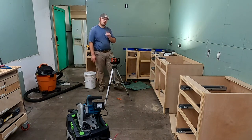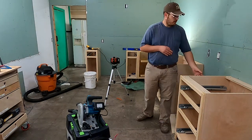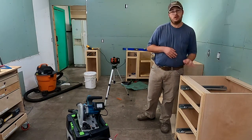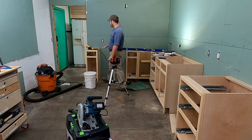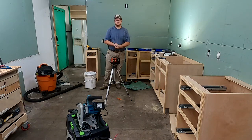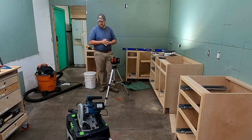Thankfully I'm doing this before I put in my floors, so I can use my floors to offset some of that gap. I'm actually going to start by mounting this one at my 34 and a half inch mark, because that is my height, and then this will start at 36 inches over here. My cabinets will probably finish about 37 inches, which is a little frustrating, but that's part of working in an older house like this.